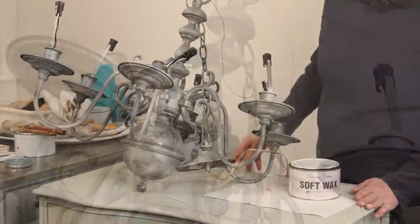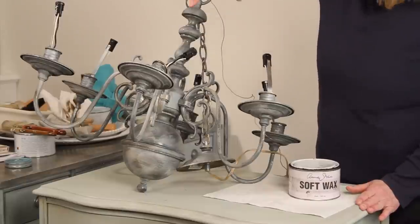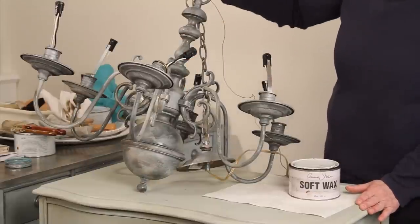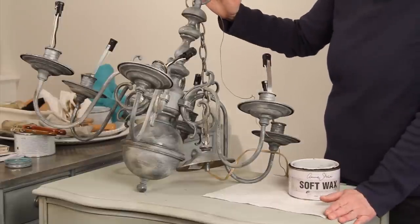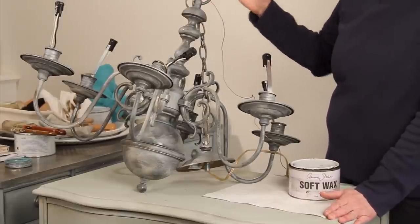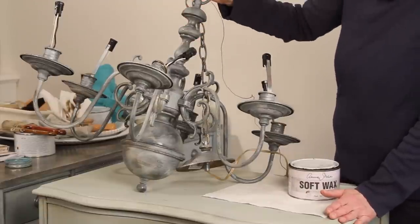So we're going to wrap this up. We've painted, applied some shiny medium to help bring out the highlights, and finally our dark wax. As far as maintaining it once finished, all it needs is a dusting with a soft cloth. You're not going to want to use solvents or any kind of soap — just dust with a soft cloth is more than enough.